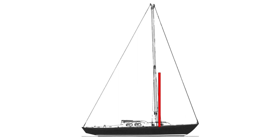Okay, so we got our A-frame standing up. Now you want to tie guys forward and aft. The forward guys we took down to the bow stanchion base and tied that off. Camille tied a trucker's hitch on all four guys. And then the aft guys, we ran those down, made those a little bit shy, and tied those just forward of our self-tailing winch.